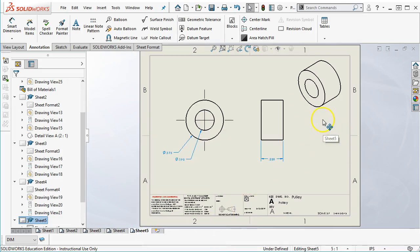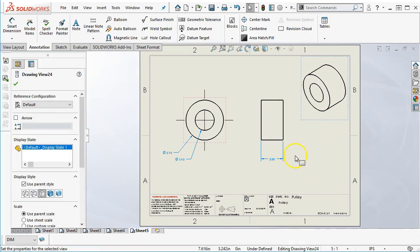So we need to go to this one. We have the 220. We did a stack up already that said our bearing had an upper limit of 220, I believe, and then the largest that the pulley could get at 210 was 215, and then the smallest to get would be 205. Right, and so that is kind of where the V groove would start to fail. The 105 is a little bit of a shift, you know, based on percentage, but we can come back to that one.